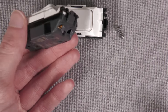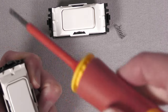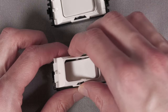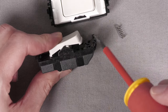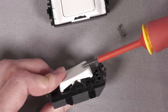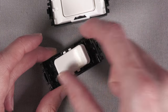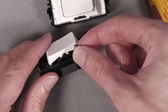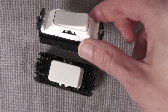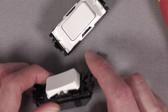The other thing I found that's quite amusing is what we have here is a normal MK two-way switch, a normal one that latches in each position. But I popped it open for a bit of a laugh. I open light switches for a laugh, yeah. Anyway, by opening that up, you can see under there, that has the same little posts that stick up from the black plastic and also the same pegs on the underside of the white rocker, because they've obviously used the same moulding. So you can actually take the spring, remove this switch rocker, and then put that spring in, and it will actually turn this into a retractive switch. Now, I don't know why you would, maybe unless you had one of these and you wanted it to be less springy and you also wanted another retractive switch and you had one of these lying around, then maybe you could make your own. But yeah, found that quite amusing.